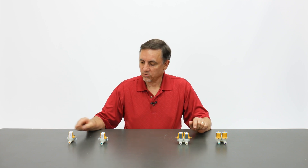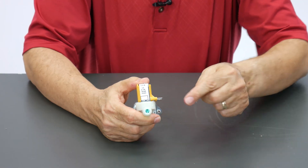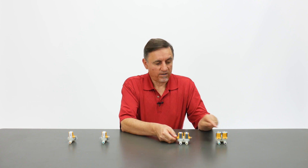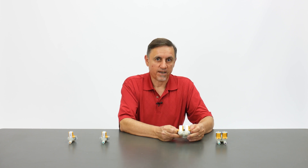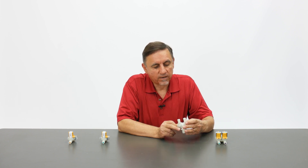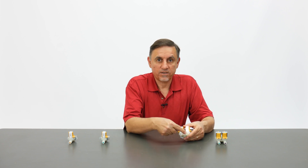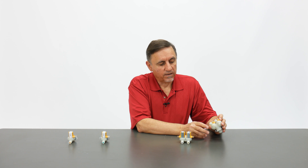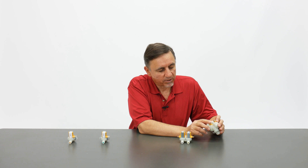These two look the same but the difference is the orifice size. This one has a little yellow orifice and this one has a seafoam green orifice. These are double fill valves — one side is the fill valve, the other side is used for drain tempering. This one has a gray orifice, and this side has no orifice, so this side is used for drain tempering. This one has a seafoam green orifice and a purplish looking orifice.